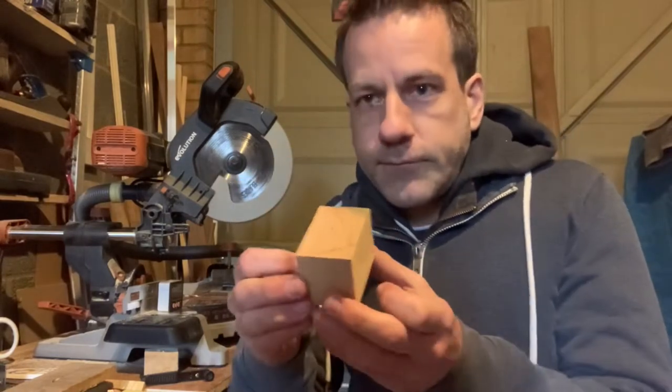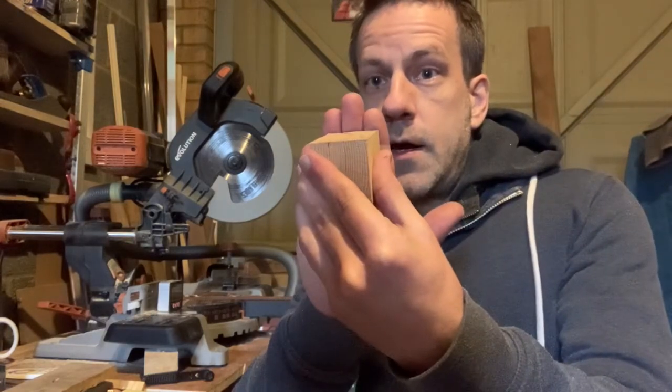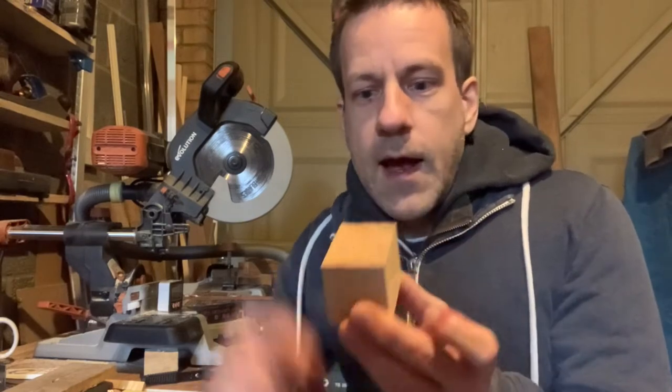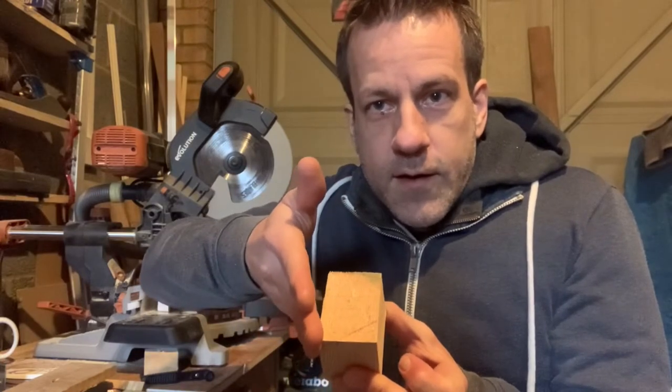Let's talk about the shape we're working with. If we start with a simple cuboid and take the front face — closest to the camera — and angle that towards the camera by 30 degrees, take the side facing me and angle that back by 25 degrees, then take the other two sides and angle those outwards by 15 degrees each, and then angle the top and bottom lines outwards by 5 degrees — that's the shape I'm dealing with and trying to work out the compound angles for.